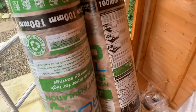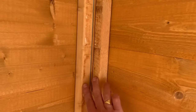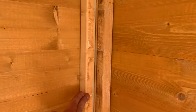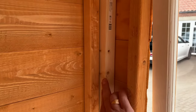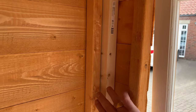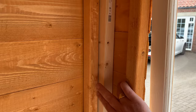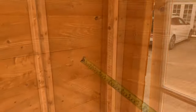I'm using loft insulation and we're going to attach this log lap to the inside edges. In some corners we're fine because we can attach to existing surfaces, but in this corner I've had to put an extra beam in because the side fence went further in. So have a look at your internal corners and see if they need any extra bracing.